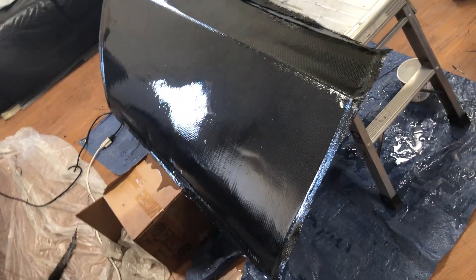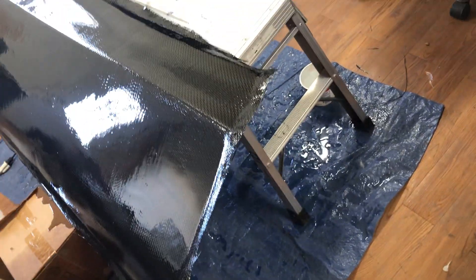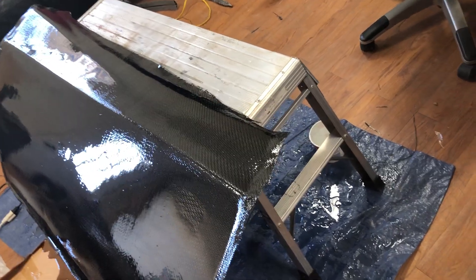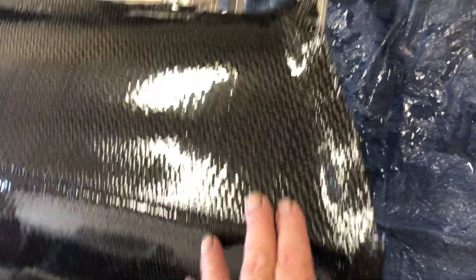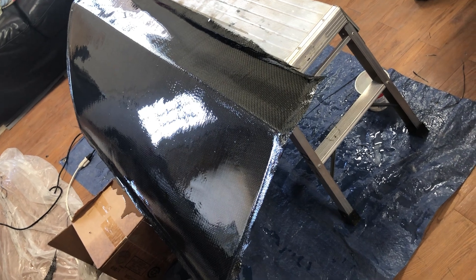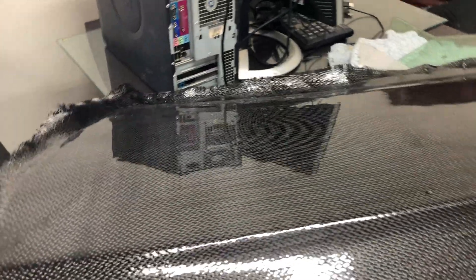So that's going to be on the agenda soon — to go off and sand this smooth. It will probably get yet another layer of epoxy after it's sanded smooth. It's kind of silly to add another layer when there are obvious issues with this layer, so what we're going to do is sand this smooth and then put another layer of epoxy. The only reason I'm putting the other layer of epoxy is there are still some areas where you can see the pattern of the carbon fiber, which means it's pretty thin right there. It's really hard to get the epoxy to hang on to those edges. Here's the other one — same thing. It's smooth where we had it sitting flat, but the areas that weren't flat ended up with a textured surface.